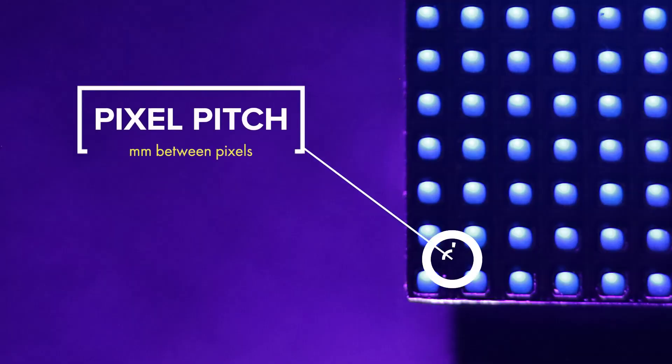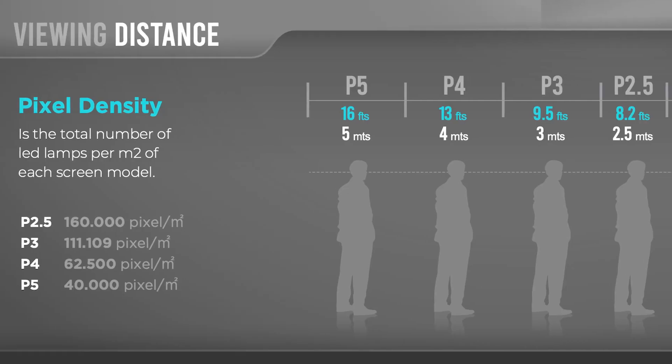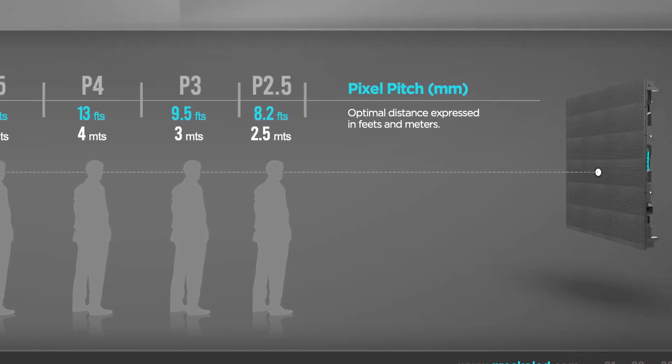If you've been exploring LED wall technology, there are a few considerations you'll have to make when choosing what product to buy. There's really expensive stuff and there's some really budget stuff. One of the specs you need to consider for your space is pixel pitch. Pixel pitch is the space between the different LED diodes on each of the modules that make up the LED panels. You'll hear numbers like 3.9, 3.5, 2.9, 2.5 — the lower that number in millimeters, the tighter those pixels are, so that's going to be a higher resolution looking screen. This is a 2.5 and in this smaller venue that seats around 160 people, it looks amazing.